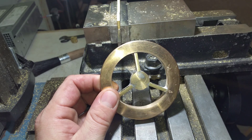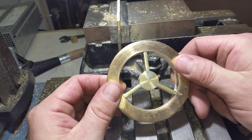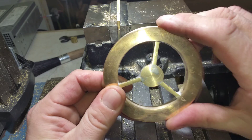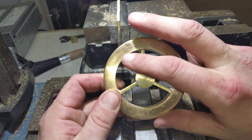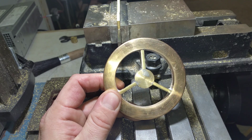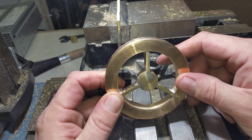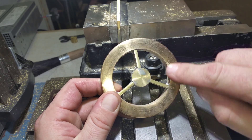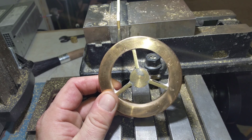When we were doing this, we noticed we got it really highly polished. If you flip the mold over, it will just literally pop right out of the mold. But the other stuff stuck inside the green sand is the problem. The thought is if we make the ring a separate piece, we can mold it in green sand, flip it over, and the ring will pretty much fall out, then tap on this a little bit to pull it out the rest of the way and have a good mold.